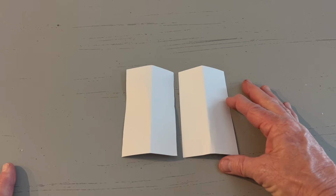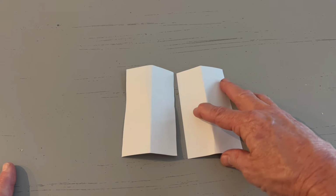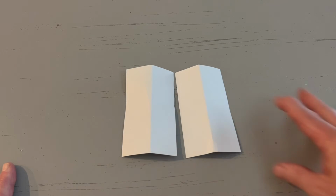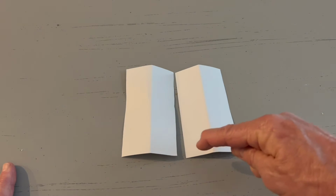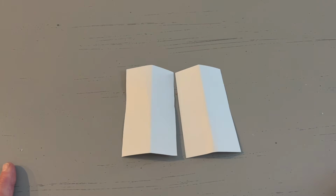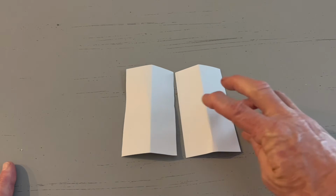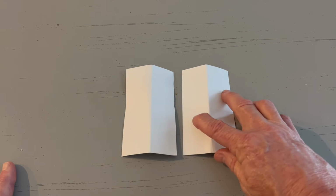You installed the first one, you don't really know how it fits, you think it's okay. And then when you install the second one, they look like that. I'm exaggerating a little bit, but the gap is really big in the bottom and it doesn't look good on top. What are you gonna do? You don't wanna shave one of these doors. Save the shaving, planing as the last resort. Try to manipulate everything. So just think about it conceptually. You need to go like that. You need to move this one like that.